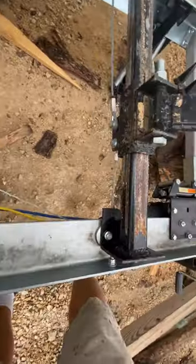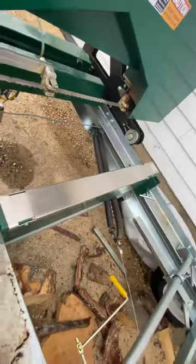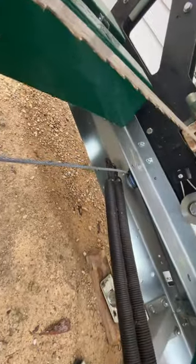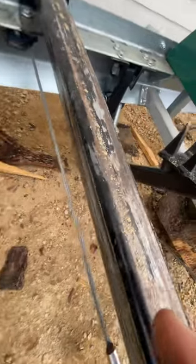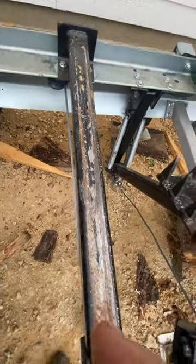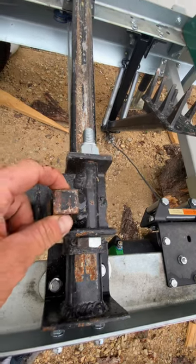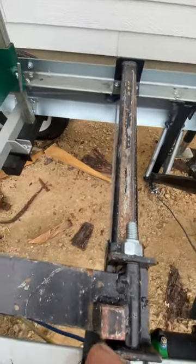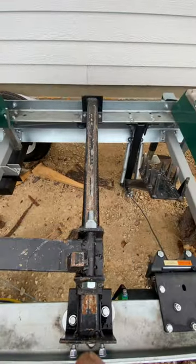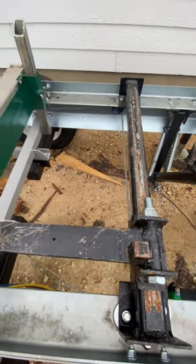I've got a return cable right there and that comes back here to the springs, mounted with an eye bolt on the rail. The winch runs across from here all the way underneath with a couple of pulleys along the way. This is made out of two-by-two quarter-inch steel, and I just did some brackets and used washers to shim it up where I needed. I welded this guy on here so that when I'm doing square cant, I just lift this up, run it in, and now this catches the square cant so it won't hit the blade — I have it at the right height so it just clears the blade if the saw is all the way down.